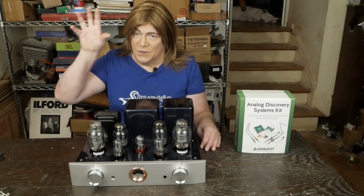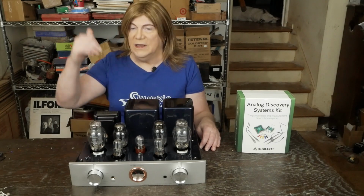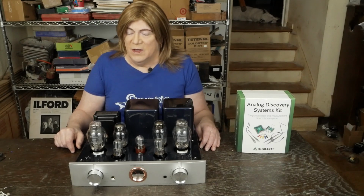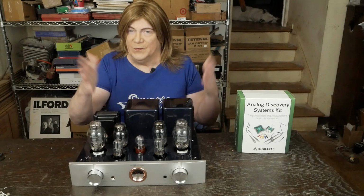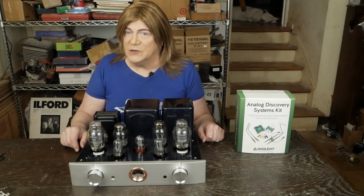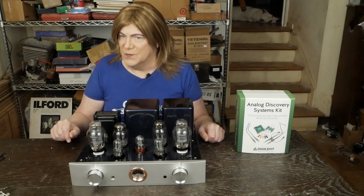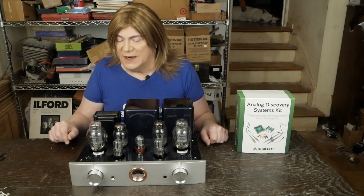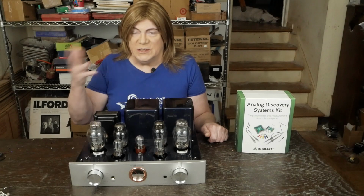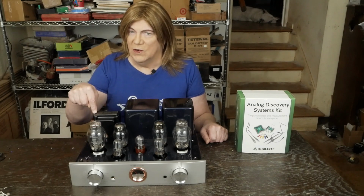And then I did a video about getting the really nice 30 watt ISO Tango transformer and putting it in my personal 300B DIY build that we've showcased on the channel. So I talked to the guy that owns this amp, and he really didn't want to drop $1,000 in output transformers. But he wanted to go a step up from these little 15 watt EdCores, which I totally understand. And while they would have worked much better than the factory ones, we discussed the different options, and I've used these Hashimoto EI-Core output transformers.